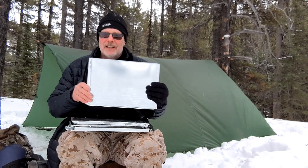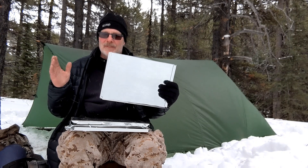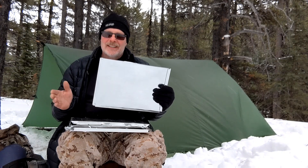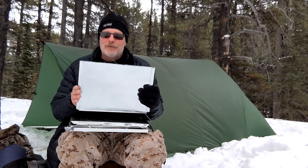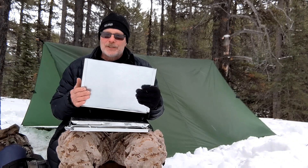In the last video I showed you how to do all the bending — the design is sound. You just come up with the measurements, use the bending tool, and make your own bends. Really easy to do. And being sheets, I wasn't restricted to the 8-inch width that the end caps come in. This new stove I went with a full 10-inch height. I still kept it 8 inches wide, and the 16-inch sheet width, by the time you get the bends on the end, translates down to 14 inches. So bigger than the last stove and lighter than the last stove.